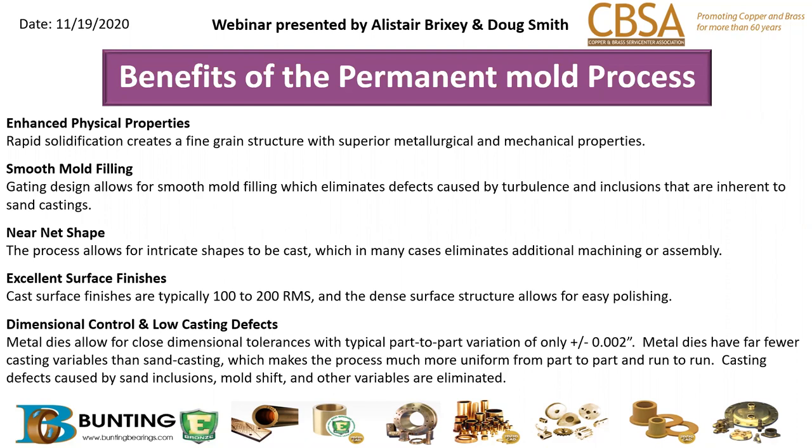There are typically a number of reasons why people decide to sand cast, permanent mold, die cast, or investment cast. Generally you're looking at the geometry of the part, the speed at which you need to make it — whether it's 300 parts a year versus 3 million — and what tolerances are required. Tooling costs also differ: permanent molding requires a steel die, sand casting does not, and die casting is generally more expensive than permanent mold.